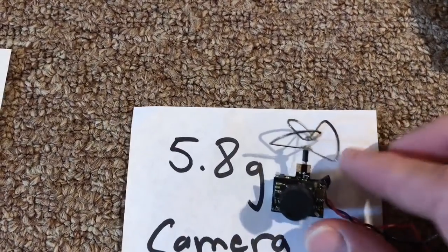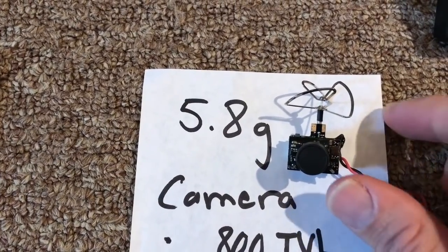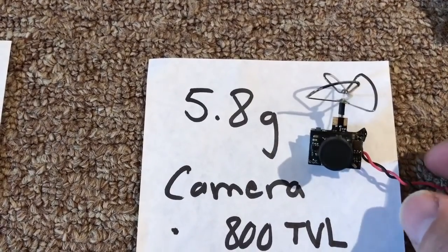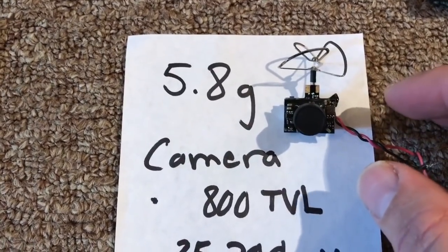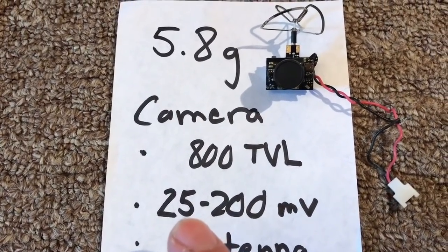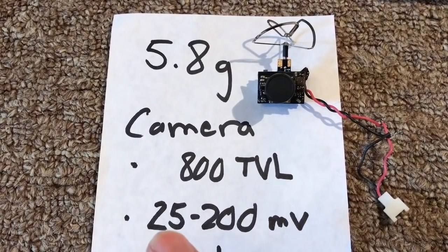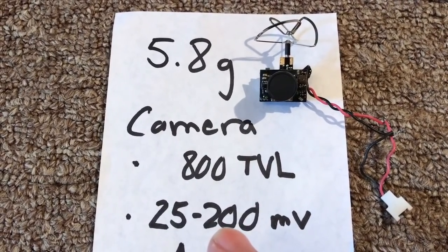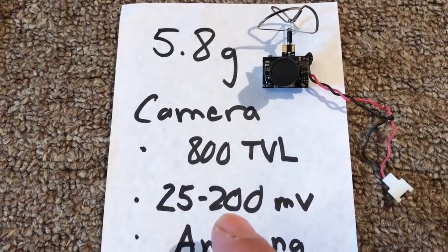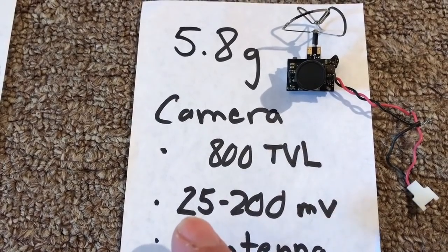I like this one here. You can get a little 5.8G camera for 10 bucks, but it's going to be very low resolution with a cheaper antenna. I like the mushroom-style antenna — it's multi-directional and gets much better reception. Since we're going to be in close proximity, it doesn't really matter unless you take your monitor outside the car. This one is 800 TV lines, so that'll be fine if I get a monitor up to 800 by 600. The transmission power on this one is adjustable from 25 to 200 milliwatts — 25 is plenty for close proximity. If you went with 200 milliwatts and wanted to take your monitor maybe 1,000 to 1,500 feet away in line of sight, the 200 might be interesting to you. But I find when you set it at 200 the unit gets warm, sometimes hot, so I'll leave it on the 25 milliwatt setting.